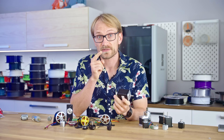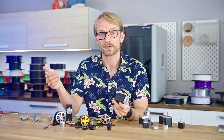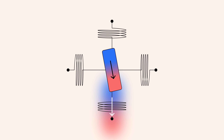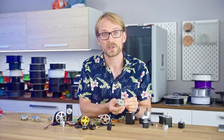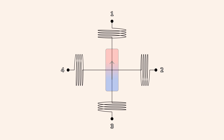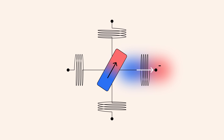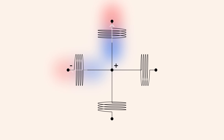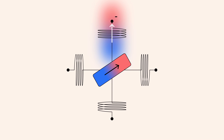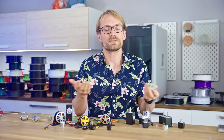Stepper motors exist because they could be driven with a super simple electrical signal. This would be a four-steps-per-revolution motor; real ones have 200 or 400, but it's the same thing just repeated over and over. Unipolar motors — the five-wire types we don't really use anymore — can be driven by tying the common lead to a supply voltage and then switching on each of the four half-coils in sequence. To spin the motor in the opposite direction, you simply run that sequence in reverse, and that entire control scheme is something you can do with simple NPN transistors, or even relays.